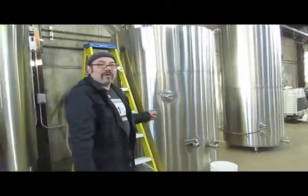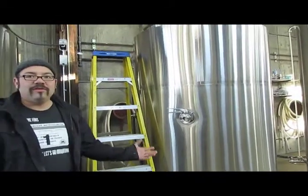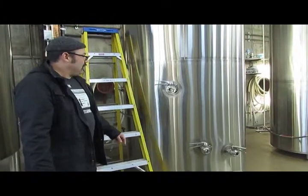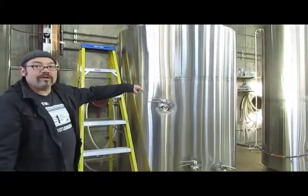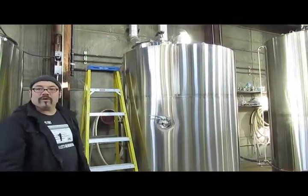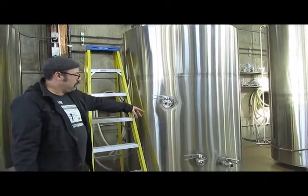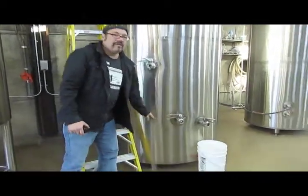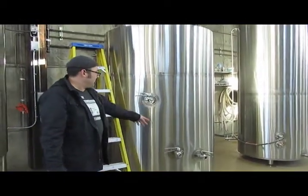With that, we boil up the water, or the sugar water, the wort, and we add hops. Then afterwards we're able to spin it around and pull off all the protein that boils out, and have that mound up in the center in a whirlpool effect, so that we pull off only the sweet wort. From there we pump it over to the heat exchanger.